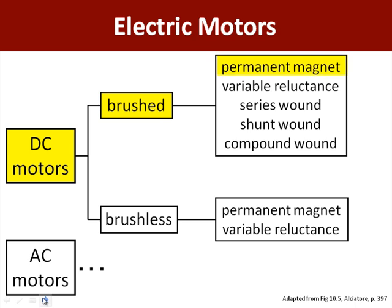The main other type of DC motors are brushless. We're going to talk about what the brushes do as we look at the different components, but the main thing to know about brushed versus brushless is that brushed are a mechanical solution and brushless are an electrical sensor type of solution. As you look at the brushes in the hobby motors that we'll be looking at, you'll see that they're very inexpensive. This means they do not last forever — you can't really abuse them. And they're an inexpensive solution.